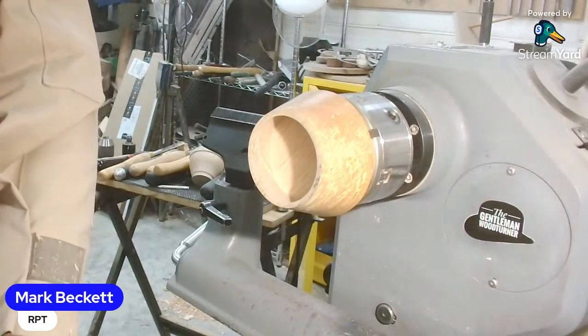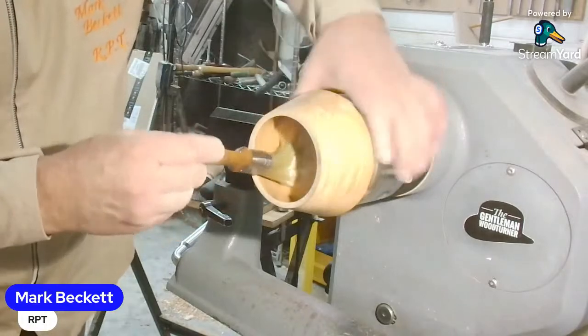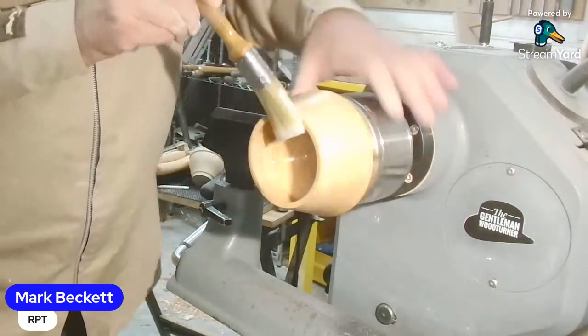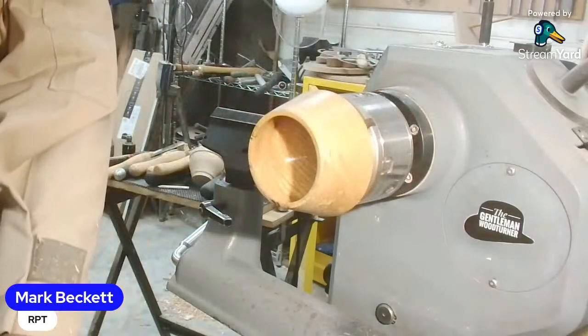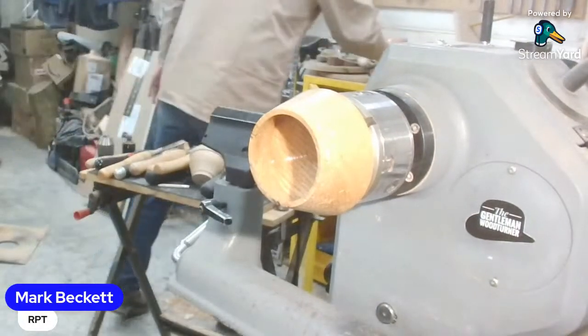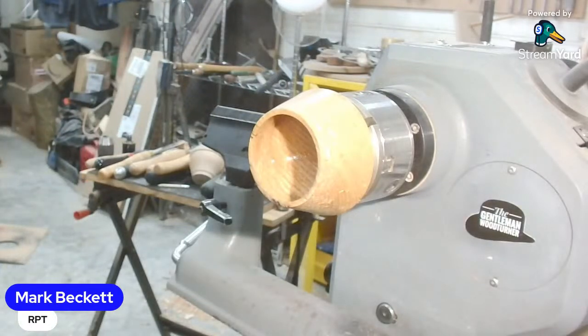I've got to say that I've been very much a traditionalist in terms of wood turning tools. I always have been, up until the point where I used Jamie's negative rake at Maker Central last year on some resin. Any other tool on it just chipped out in chunks, but the negative rake came off in ribbons, and that was the turning point for me to accept that there is a place.